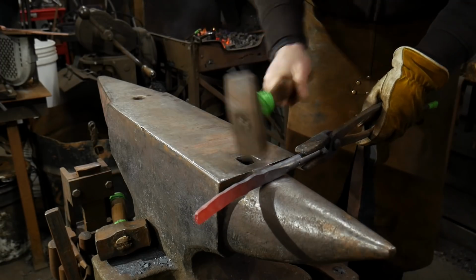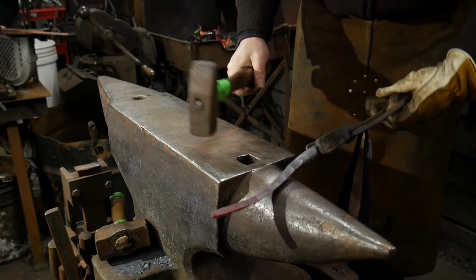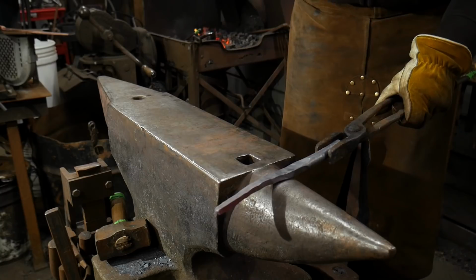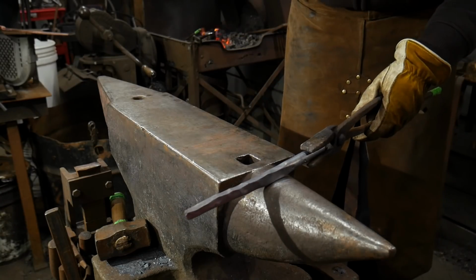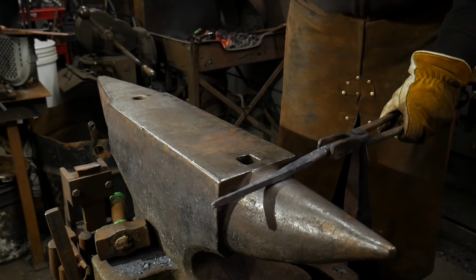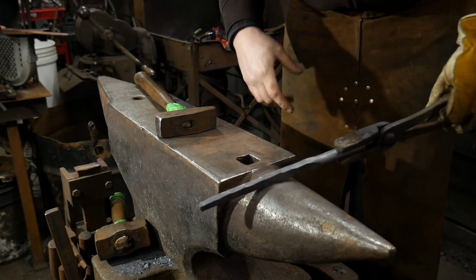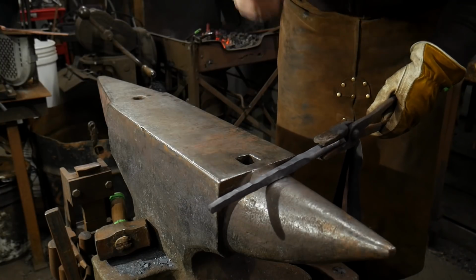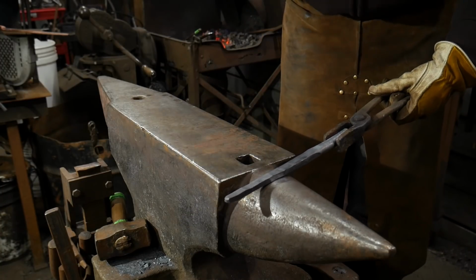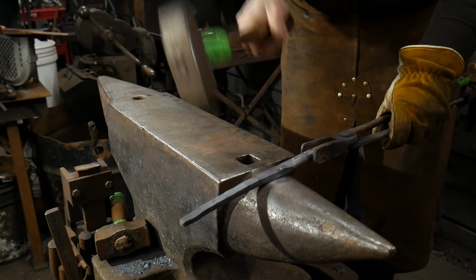I like drawing out my tong reins rectangular because I feel that it gives me a lot sturdier tong reins. Well, it's not just that I feel, it's a fact of physics. It's harder to bend a bar edgeways because there's more mass supporting it than if you made this all, let's say, a 3/8 or 9 mil round diameter rod. It's not going to have the surface tension that this rectangular shape will, and so it won't be as nice at giving you resistance or springiness.